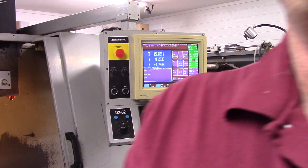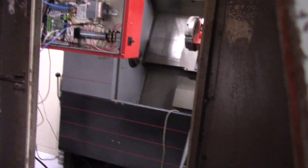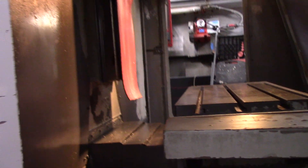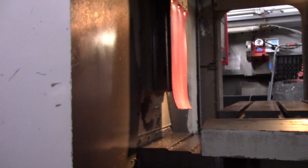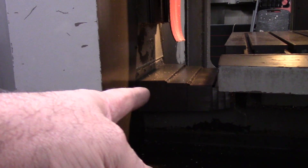It's a pretty tight quarter, so I'm going to go handheld. There's a quick look on the inside of the cabinet — spindle, carousel. It's pretty dark. The plastic on the doors needs to be replaced; that one's missing altogether, I have the handle, and that one's cracked. The door's not terrible but it's been broken right there. The door over-interlock has been defeated. Here's a look from the left side of the machine. I also have the new Z-axis way cover, and I have new seals for the Teleflex telescopic cover on the Y.